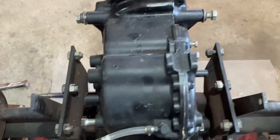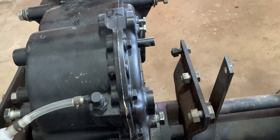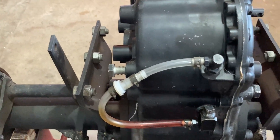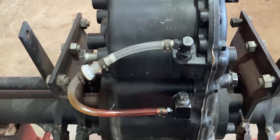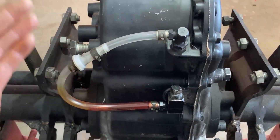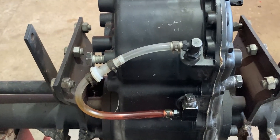When we're looking at it from the top, we have six bolts — three on the left and three on the right. These bolts will mount directly up to our main frame. On the back of the transmission we have our sight tube; this tube allows us to see the level of the fluid that we're going to add. We have a breather right over here — this will allow us to fill up with transmission fluid and it will not bubble up on the funnel.